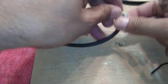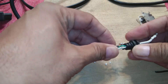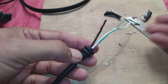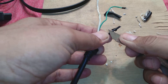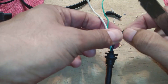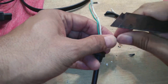Cut down this insulation, then pass the black wire, white wire, and green wire all through the grommet. Now I've brought out enough wire to make new endings. If I scrape the insulation from this black wire you can see it had been cut - the cut is now visible. This new wire ending I will solder back onto the board.